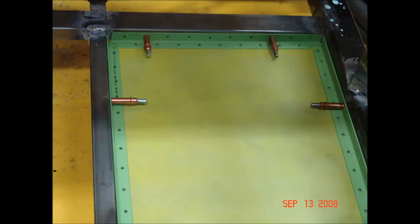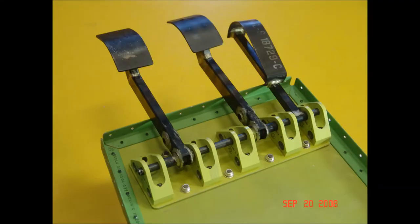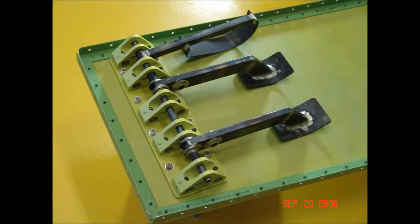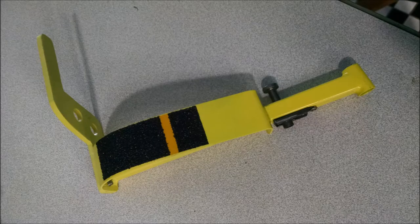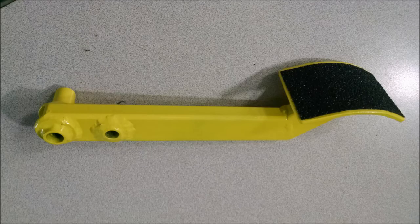I made a heel support plate which is also where the pedal assembly bolts to. I had originally built some pedals but wasn't quite satisfied with how they came out, so I made another set using aircraft aluminum extrusions — put everything together like a set of Tinker Toys and it turned out relatively well. The pedals were finished with the same epoxy primer, bought from Aircraft Spruce — a two-part primer that gives a nice, smooth, hard, glossy finish.